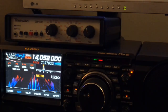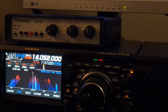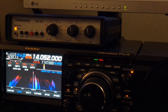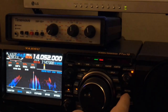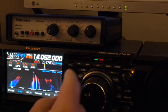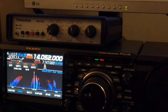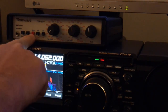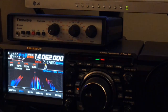If you can hear them fine at 150 or 200 hertz, that's great. If you're in crowded band conditions, you may have to run it down to 50. I've got audio peak filter engaged as well. Now let's undo all this and see how well the DSP-59 Plus can do it. I'm putting it into APF mode — they don't call it that, but that's what it is. I'll leave the digital noise reduction enabled.